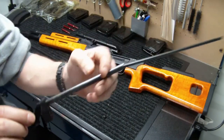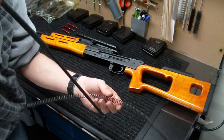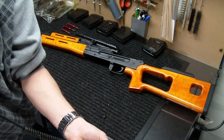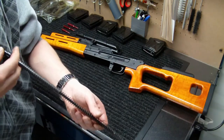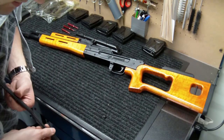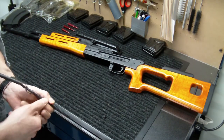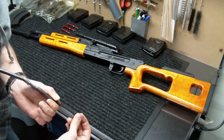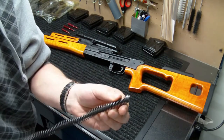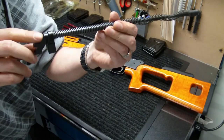Getting the spring back on the guide rod is a little more difficult. You need to hold the guide rod pointing downward so it stays in position. Put the spring up over the guide rod, hold it against your chest while continuing to point it downward, and slowly compress the spring until you can see the end of the guide rod. Then replace the nut, slide your spring over the nut in the correct position, and now you have your reassembled guide rod recoil spring with the buffer on it.